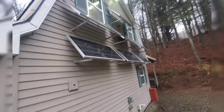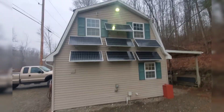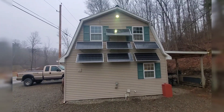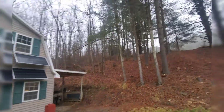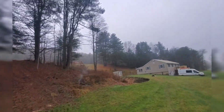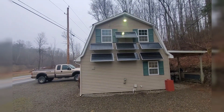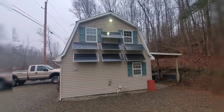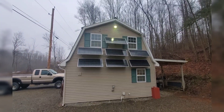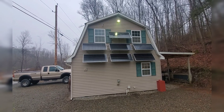I'll probably get some more of those brackets for other projects. Right now those are 200-watt, 24-volt panels. Yesterday, in an almost perfectly sunny sky, I was getting 1,000 watts in there — not bad, considering we're kind of in a hole here and I don't really get the sun until it comes across there. So I'm probably going to add two more panels since I've got room. I'd rather try more panels first than get another battery. It'll take a little time to recoup the money, but it's also another backup source of power in case my generator goes bad.